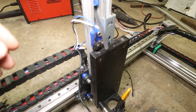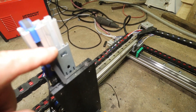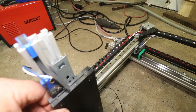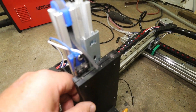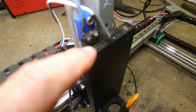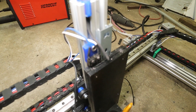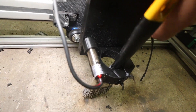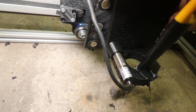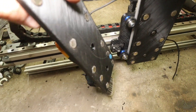The Z-axis, whatever you like to call it, has some features. There is that type of floating switch - there is a separate rail here, that type of drawer slide. So there is a floating switch, and when this is run into the bottom or into the material that I want to cut, it gives away there and this so-called floating switch is activated. That's how you know when you are in reach of the material. There is a break-away switch as well, and this is 10 - or actually 20 - small magnets. It works fine.